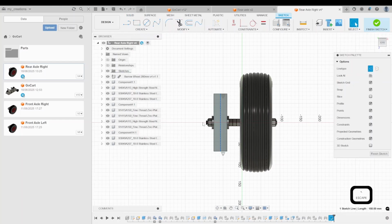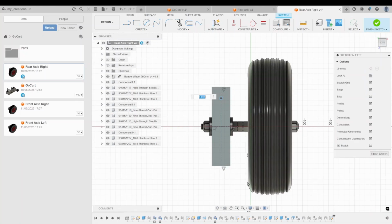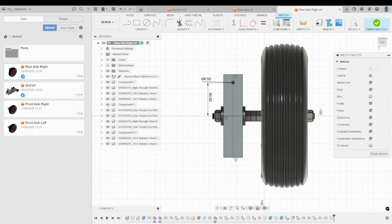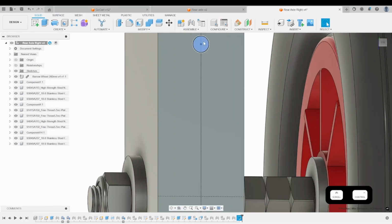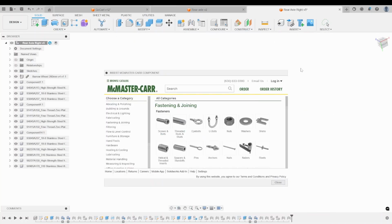Next, I measured the position of the wheel from the baseboard by measuring the bearings distance and drilled a 12 mm hole in the baseboard at the correct spot. On the other side, I secured the wheel mount with a lock nut. From the top, two 6 mm holes are drilled through the wheel holder, and the whole assembly is mounted to the baseboard using M6 screws, washers and lock nuts.